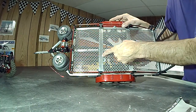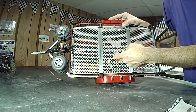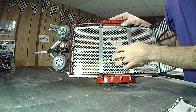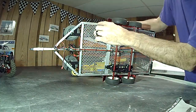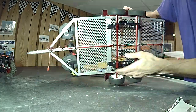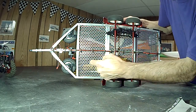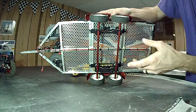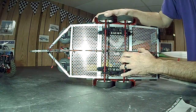This thing started as nothing but four-foot bars of U-channel aluminum and a four-foot by three-foot giant sheet of extruded aluminum platform material that I had to cut to fit the frame. I basically started with a rectangle, and the whole thing is screwed together. I actually had to create special plastic inserts, CNC machined them to fit inside the channel to make sure nothing moves.